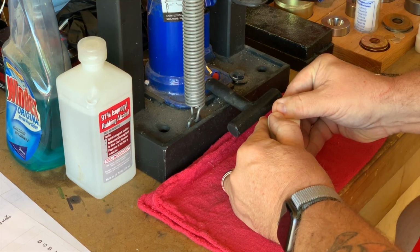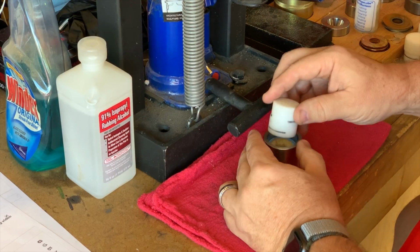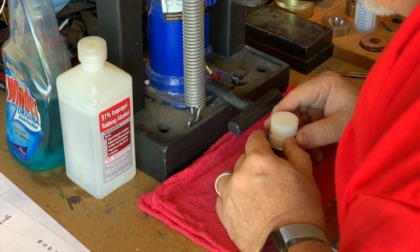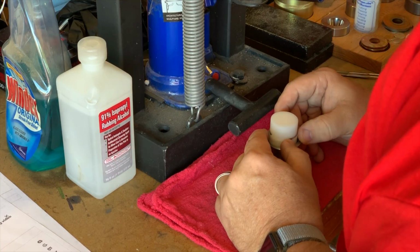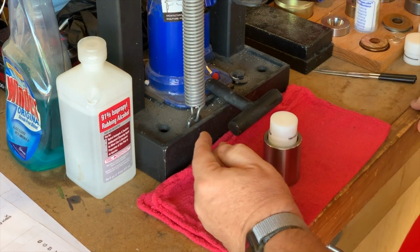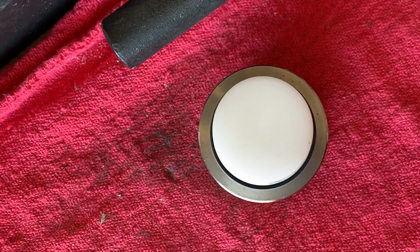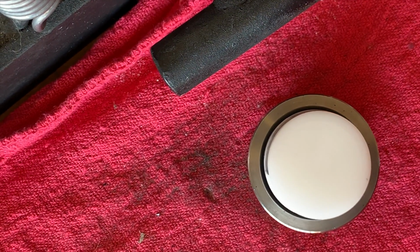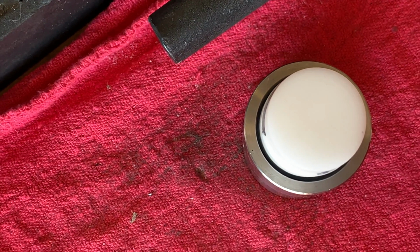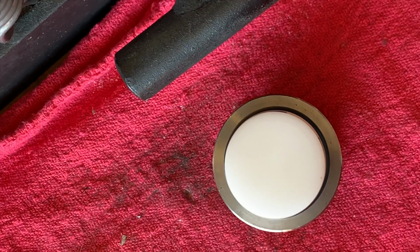The thread tape makes the coin a little bit bigger, and so I always use a slightly bigger pusher just to square it up inside the die. Then I take the pusher that I'm actually going to use and I center it very carefully. If it's off center, it can pop off the edge of the coin and destroy your project. Notice here the equal distance between the walls of the die and the walls of the pusher. This is what you're looking for.